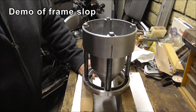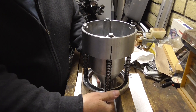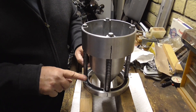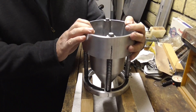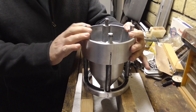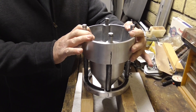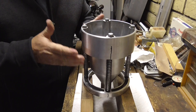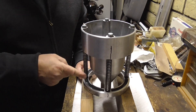There's one more thing I want to share. When I checked how perpendicular the head was to the face of the tire wheel support, it was pretty good as far as I could tell. But the big problem is when you put the tire on, this pushes away — which is the same effect as pushing down. When I go down like this, can you see how much I'm rocking that? This frame is not rocking; this is rocking because of the slop in the holes. It's rocking probably two or three degrees — quite visible. And what does this thing actually measure? How much a tire rocks. So can this be trusted? My opinion is the answer is no.